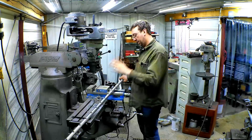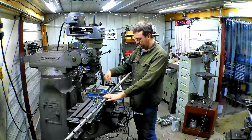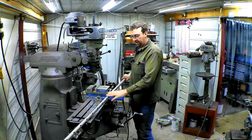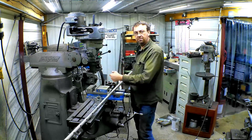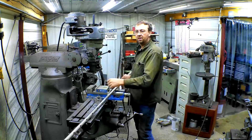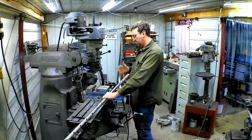We got all of our half inch square holes broached, and we're back up at the Bridgeport. The next thing we need to do is drill and tap for a set screw. I think I'm going to drill and tap for a fine thread, probably a 3/8th set screw. I'm going to drill them here and then hand tap them just because I don't want to have to switch the bit between the drill and the tap. Let's get started.